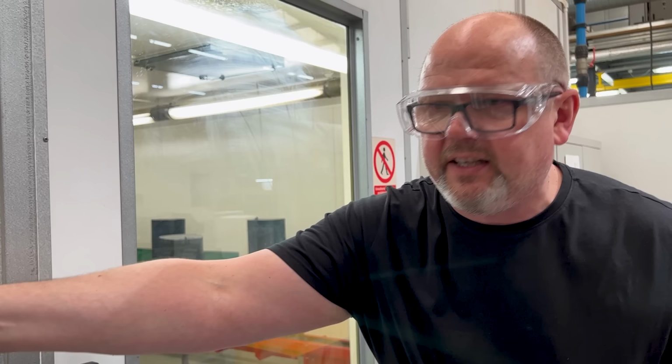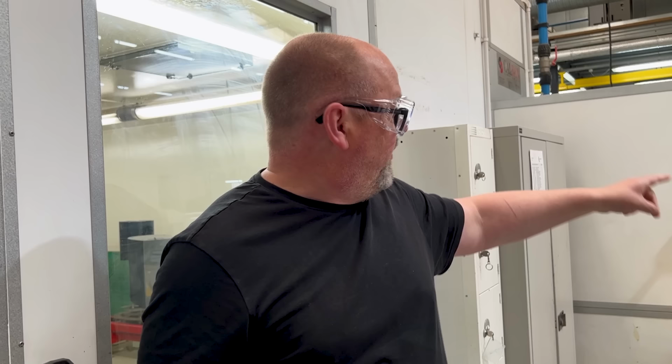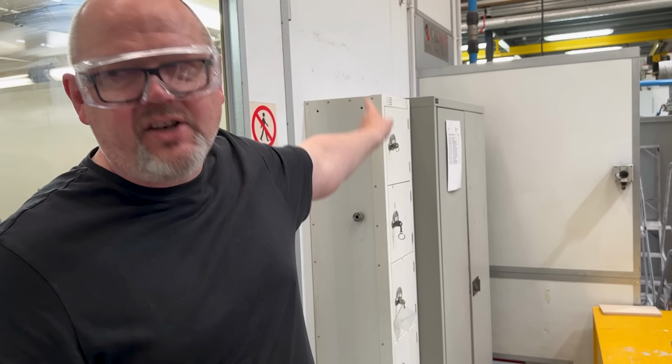It's like a giant rotisserie oven, when you think about it. When they emerge at this end into free air, they're being cleaned and they're going past vacuum benches, which are sucking away any sawdust that's in the environment, and clearly we're in an area where there's a fair amount of sawdust. We don't want to paint onto that. As they go around the guys clean them, before they enter the chamber at the other end to be painted.